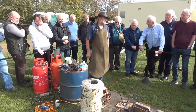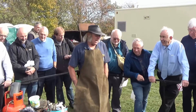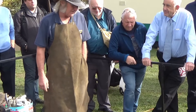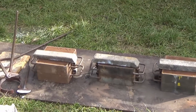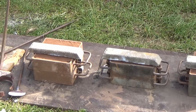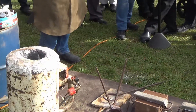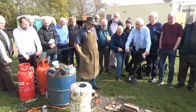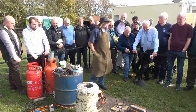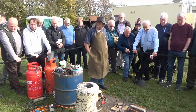Right, ladies and gentlemen, the appointed hour is here. It's approximately one o'clock. This afternoon I'm going to attempt to pour these three moulds you see set out in front of you. Each one has got several small components in it, and you may wonder why they've got a lead ingot laid on top of them. The molten metal will generate quite a considerable hydraulic force, and were it not for those lead ingots, it would simply float the top half — the cope — off the mould, and the metal would run out. Hence, the ingots.